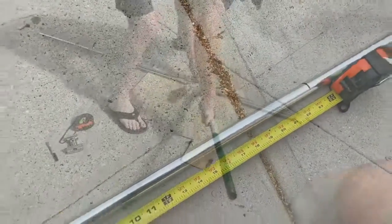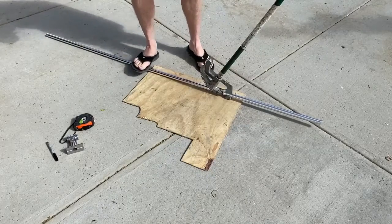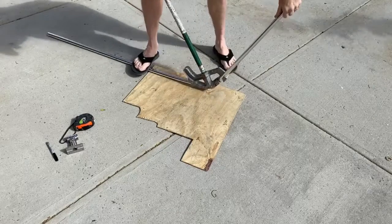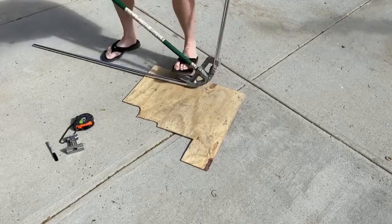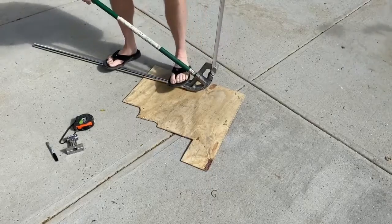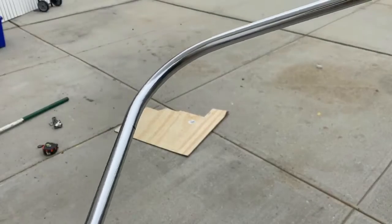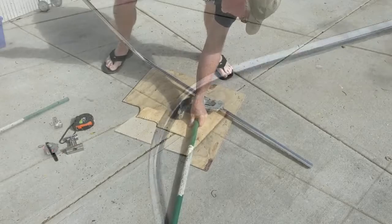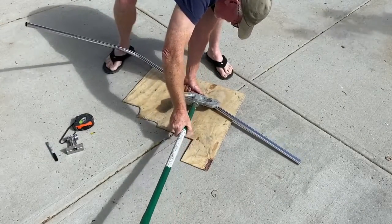That's bend to bend. I started out with a total six-foot piece. I found the centerline and then measured back from that. The aluminum tubing actually bent very easily. I lined up the arrow and bent it to that 90-degree mark. These tube benders have a little foot rest — I probably should have worn sneakers or work boots, but this is what I did. The tube actually bent that aluminum really nicely, so there's no creases. I was a little bit concerned because the tube bender was not made for seven-eighths tubing.